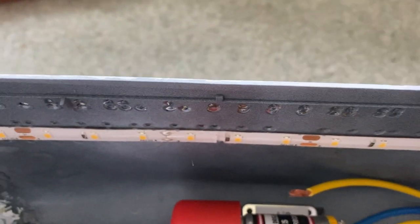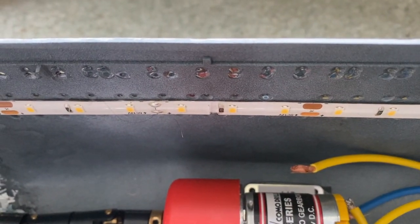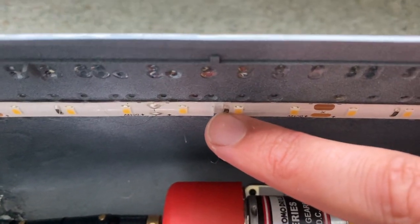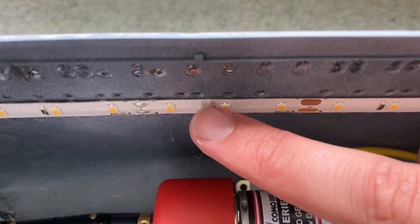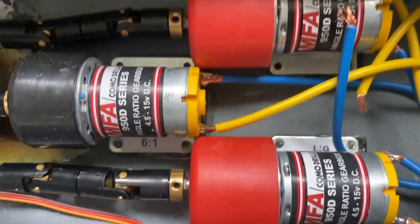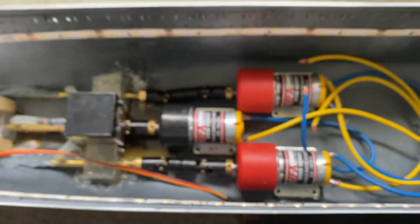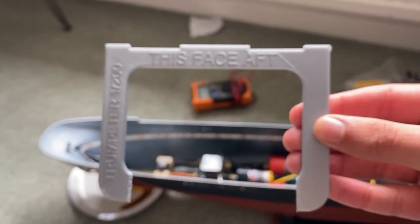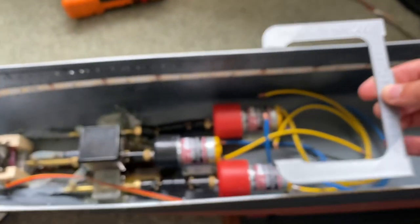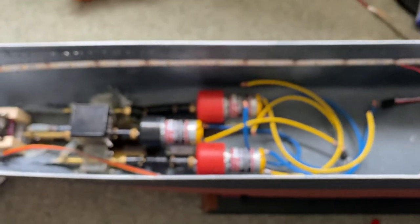And this is where the first bulkhead goes, just there. And what you can see I've done, I don't know if I can quite get the camera to focus on it, is I've just cut the gel which gives this LED strip its IP rating out for the section where the bulkhead will pass through. And I've done the same on the other side, there. Now I've bought these bulkheads from Titanic Honour and Glory, which I will leave in the description, and I've just edited them slightly to allow them to fit over my motors like so. So I'll go and add these in now.